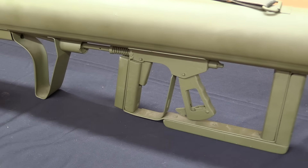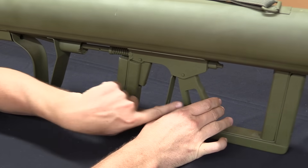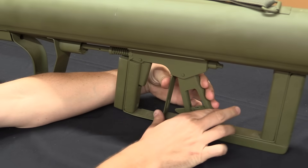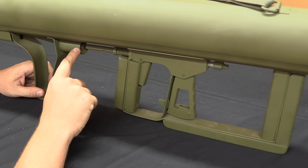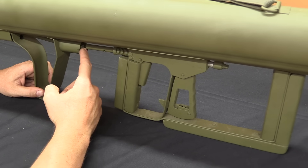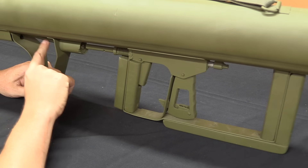The firing mechanism is pretty cool, and totally different from the bazooka. This looks like a trigger, but it's actually a cocking lever. When you squeeze it back, you're compressing a spring and pulling back a bar. There's a safety — this is actually a late-war upgraded safety that you don't find all that often. What you do is cock that, the safety locks it in place, and now this bar is sticking out. What's in here is actually an electromagnetic generator: a winding of copper, a magnet, and an iron core in the centre that can move. When you pull the trigger, this rod gets shot backwards under spring pressure, hits the centre of that movable core, throws it backwards, and that core moving inside the copper winding and magnet generates an electrical impulse, which is transmitted by wire to the back of the gun.